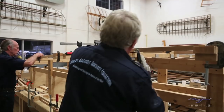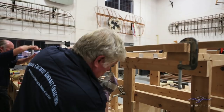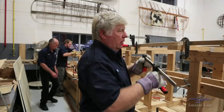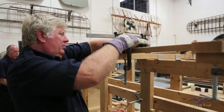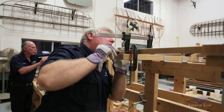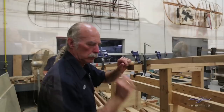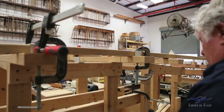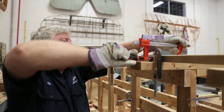During the clamping process we're using an aluminum angle. Because the wood is steamed, it's really soft at this point. If we were to not put those aluminum angles on there, there's a possibility that the clamp would actually damage the wood. So that's why we're putting that angle on there. The first clamp is just to secure the longeron in one plane, and then the other clamp is to make sure it's pulled next to the jig, so that in that plane it's where it's supposed to be. So we're kind of dealing with two different planes.